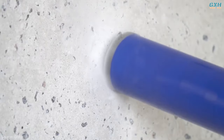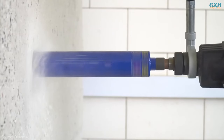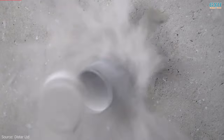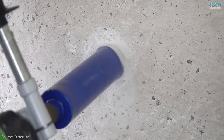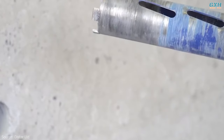The RMTX Drill Bit is designed for high-speed drilling of complex materials in dry mode. The drill bits use diamond segments with oriented diamond; the turbo shape of the segment and the productive bond ensure efficient high-speed drilling. They come in a range of outside diameters from 42 to 150 mm and lengths of 300 and 450 mm. Experience the unsurpassed drilling speed.